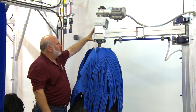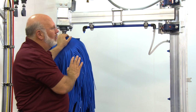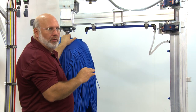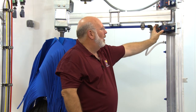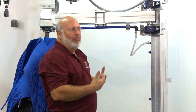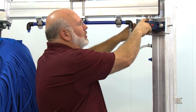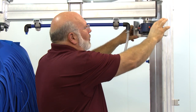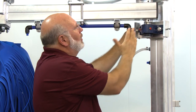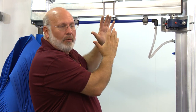These rotational bearings will be greased weekly. On the backside, we've got two pivotal bearings that only move about 30 degrees — from where the brush rests to the widest vehicle position. Because of that short motion, which is not good for a bearing, we've put in double-tapered roller bearings, pillow block style, with two bearings in each one designed for heavy load, low RPMs, and low motion. We went to a stainless steel shaft set into this arm with a keyed collar and a set screw, two jack screws to hold it level, and two big slotted holes to adjust the pivot and camber of the bearing. This has been really engineered for a long life — a big upgrade from what we had in the past.